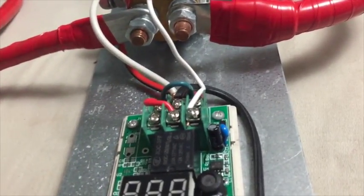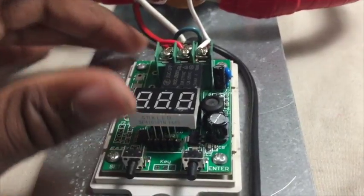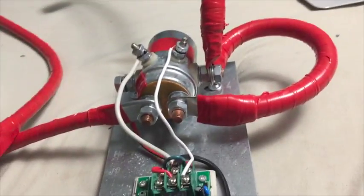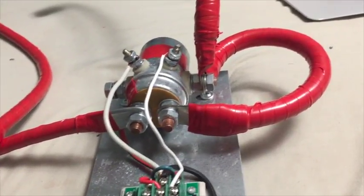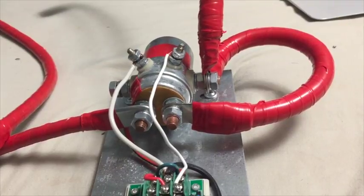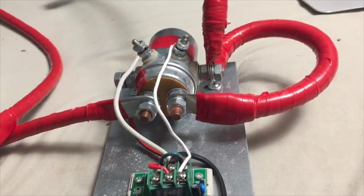If I had to build this again I'd mount the shunt directly next to it — maybe even put it all in a Cantex box with a voltmeter on the front, making my own custom controller. I could actually do that for a couple of you guys if you're interested in seeing how it works. I'll be working on more when the new parts come in. I'd like to separate the negative side as well, but basically I've made a way for my wind turbine to run both a 24-volt and a 48-volt bank. If you have any comments, put them below; like and subscribe.